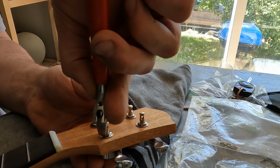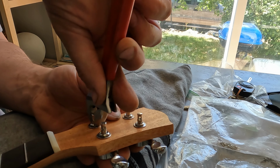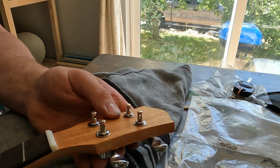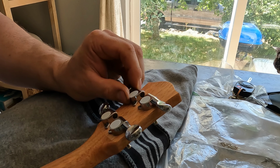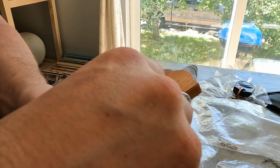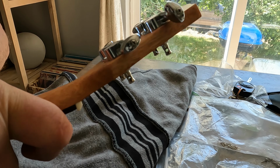And I bought a template as well. The template indexes off of the fingerboard and positions the bridge in the exact position to have the right scale length. And so here I am just mounting these. And you'll see that template later on to space the bridge, and I actually bolt the bridge to the body. So there's some of these sandwich with a little threaded union, a collar. They thread on there, and then there's a screw that goes into the wood on the back side to keep it from pivoting. But I pre-drill those with a very small drill bit.